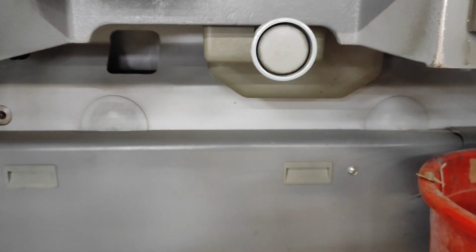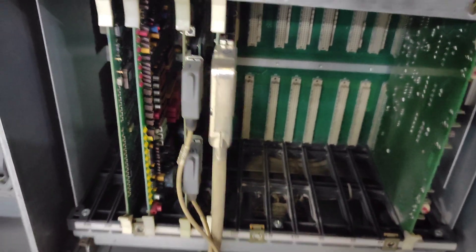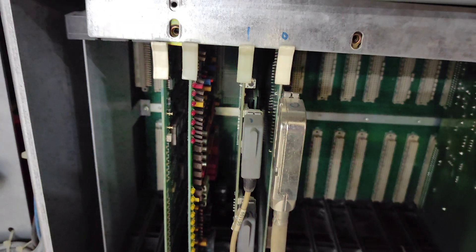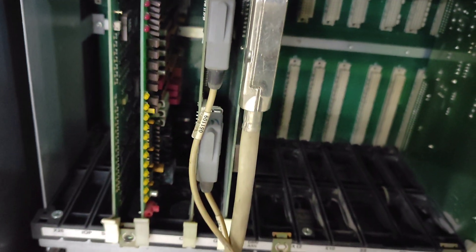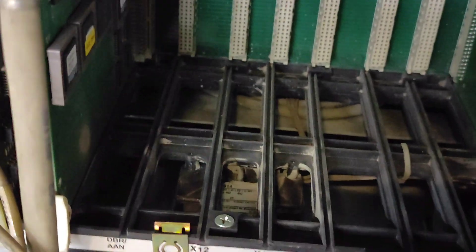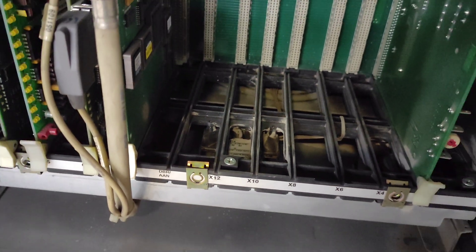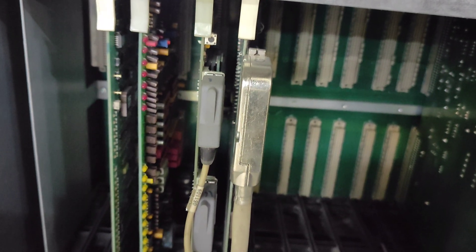We will check the SK95 controller card — the safety card. We open the downside cover and will check the input/output cards. After opening, we clean any machine blocking because of the safety. Whenever we need to troubleshoot, first we need to clean, because sometimes because of bad contact or dust the unit is not working. We will clean this, retighten these cards, and then check.